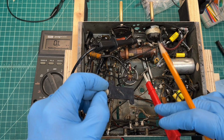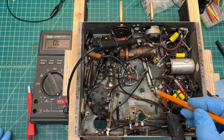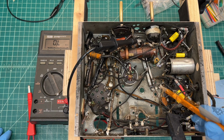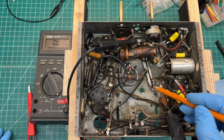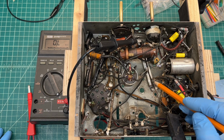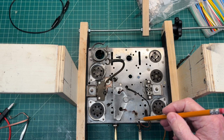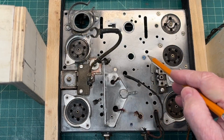Again, you never know what you're going to find in these things. So I'll use my spring tools, chisel, to remove the rivets or drill them out from the top. I'll look at that. Then we'll look at replacing the resistors with the proper values. We'll do a little more due diligence here on the candohm once we get it out. Just to ensure I'm drilling the correct rivets out, I've marked these in blue.